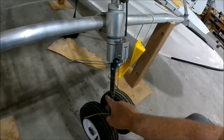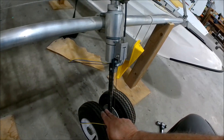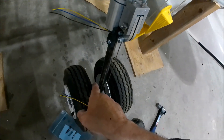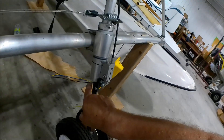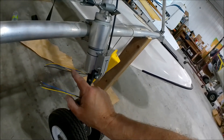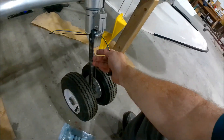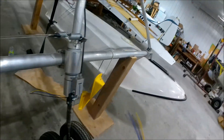The magnetic reed switch I'm going to put on here — like you would find in a common security system — they're completely potted and sealed. I need to make a little bracket to go down here to house the magnet, and a little bracket over here to house the switch. When the wheel is up and close — within about half an inch — it will close that circuit and say the wheels are up. I now have to get a magnetic reed switch for the wheel position sensor on the nose.